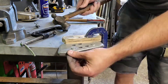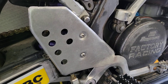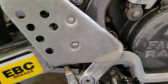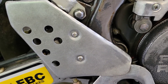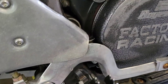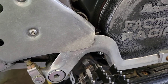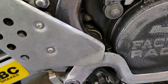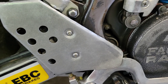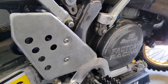I finished up hammer forming the edges and dimpled where the screws go through, so there's a little pocket there, and I've got some recessed button heads. I went ahead and bent this material up for where the brake pedal sits behind it. I also had to make this radius here a little bit larger than it was on the form, so I'll make those adjustments for the next one. This is more or less just a test piece to get things going.